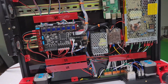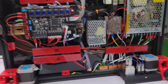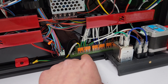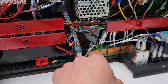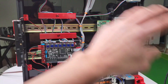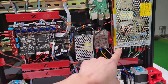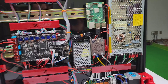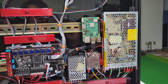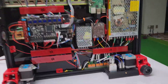This is on the bottom of your printer — you're never going to look at it. But I cleaned it as best as possible with these wiring covers so it's nice. The biggest difference between a regular 2.4 and the 2.4 R2 is the addition of these WAGO holders that you mount. My layout is completely different because the latest FormBot kit came with a Meanwell power supply that was different, so I had to mount it vertically. I ended up with a sort of custom DIY Voron wiring.